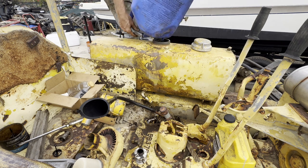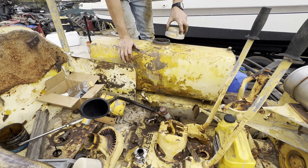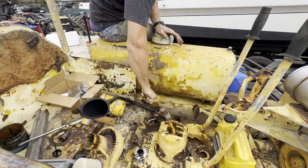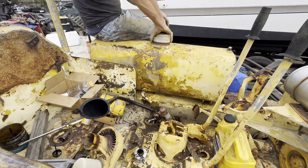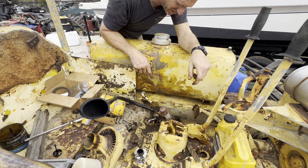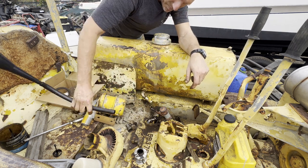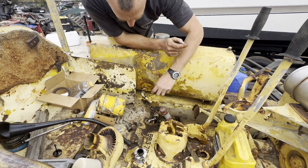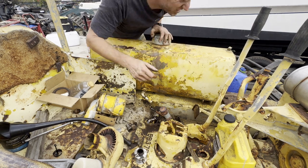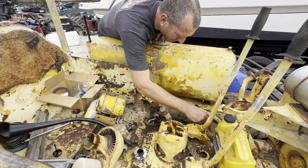Definitely be flowing now. Alrighty. We have diesel. Oh yeah, beautiful. So this looks like a 5/8 line compression, and it looks nasty. So I think what I'm gonna do is run a marine fuel line from here all the way down there, because this thing has been in there for a really long time.